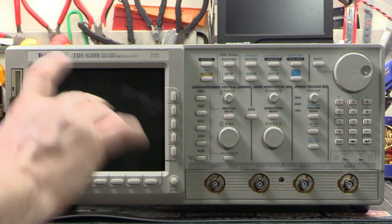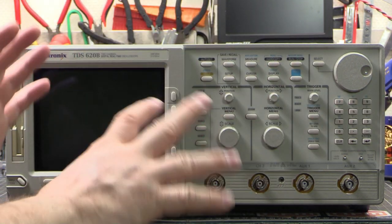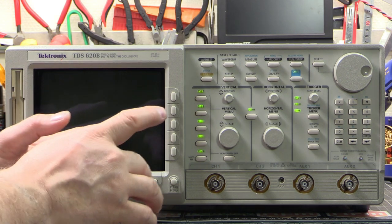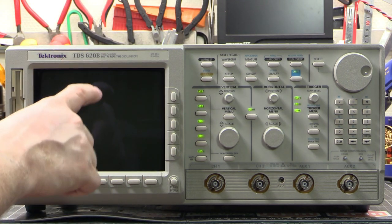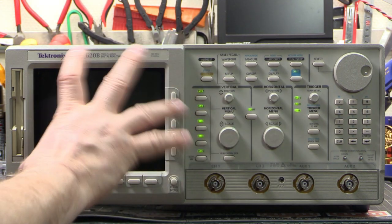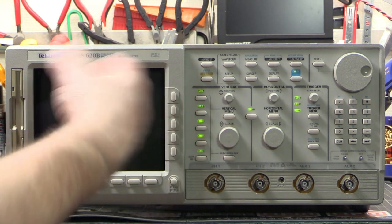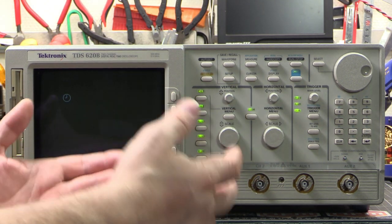I've got it all back together and it is working correctly. I've already run through a few tests to make sure before closing it up. But there is one more critical step: if you turn yours on you may find it still shows the same error even though you've replaced the relays. That's because there is a thing called SPC - Signal Path Compensation - that you have to run to let it self-calibrate the inputs. Otherwise it will still have calibration constants from when it was tested with bad relays. You need to clear that out and let it recalibrate with the new relays, and you should be running this relatively regularly anyway because temperature drift and time can cause things to drift.